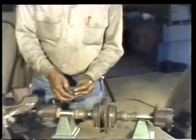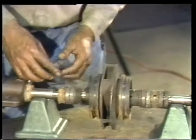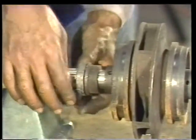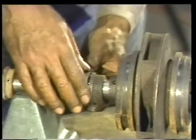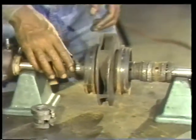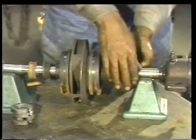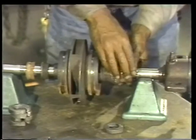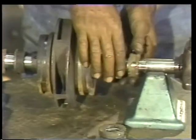When you're done with the casing, start disassembly of the rotor. Remove the rings of old packing material and inspect each one. If any of the rings are stiff, scorched, or shredded, this usually means that the gland was not properly lubricated. The gland follower could have been adjusted too tightly, or the gland sealing line might be blocked. Both of these possible causes must be checked before reassembling the pump later on.